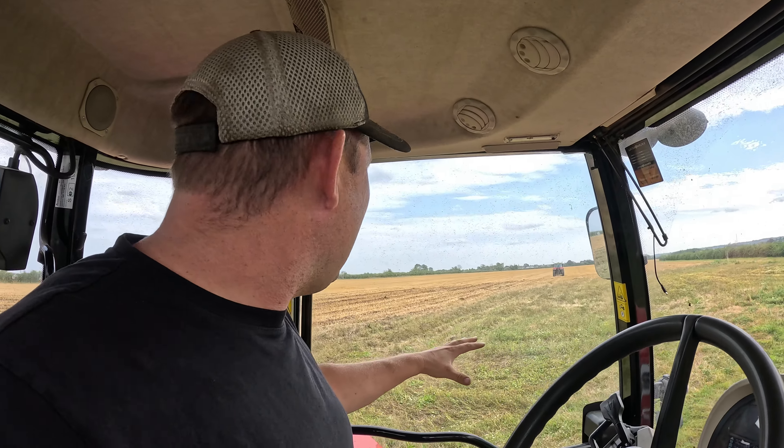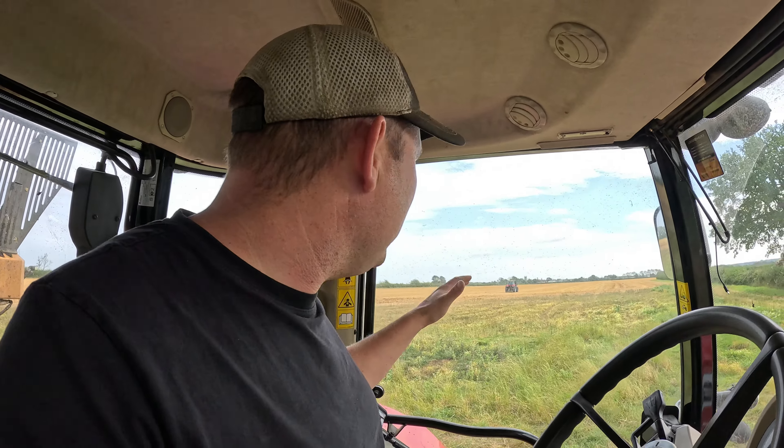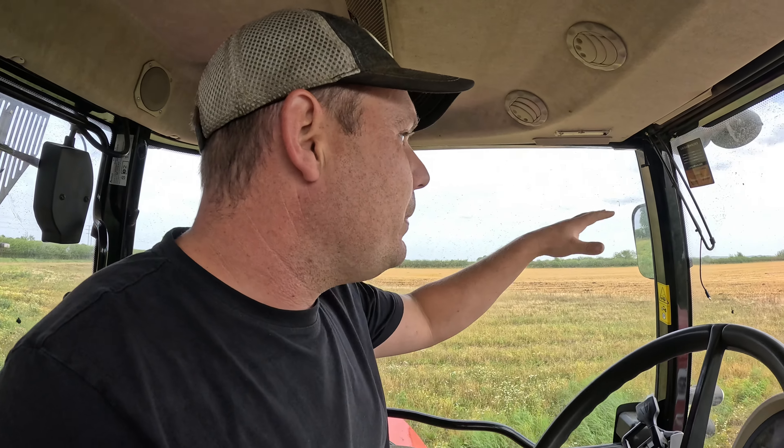This is a wet area. Daisy's going to get through all this area, then she's doing the next field which is a wet field, and she's got some others around the area to get on with as well. It always leaves a little hump where the mole goes in — that can't be helped. Keithy always starts with the mole, then the cultivator, then we let it weather for as long as possible. We let it green up so all the weeds, last year's crop, and volunteers — that's the crop we didn't collect in the combine — can grow on as much as possible before we go seeding winter wheat. We want to break the soil down into a nice tilth that we can drill into. For winter crops it doesn't need to be crazy fine because it's going to have all winter to sit there. The mole work is really important for us — it's an important job.